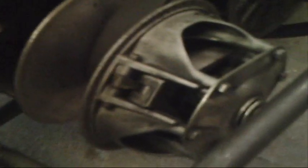We're not cutting anything here on the drivetrain — this is all snowmobile setup, same belt setup. We had to mount our bearings in here and add a sprocket for the chain drive sprocket. Hopefully we have the proper ratio right now for this setup in order to give us a top speed probably around 90 to 100 miles an hour with this sprocket.